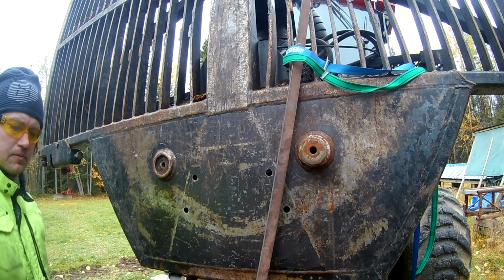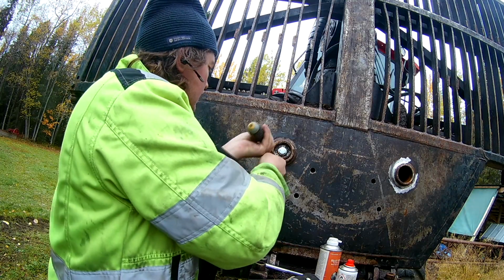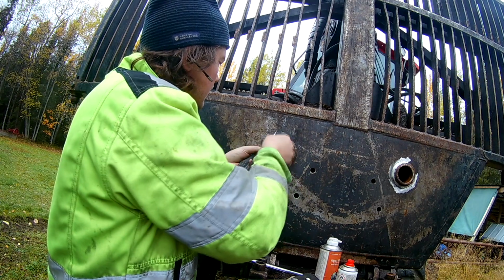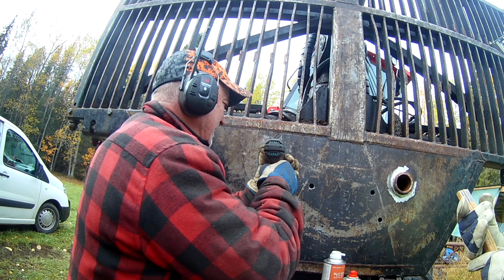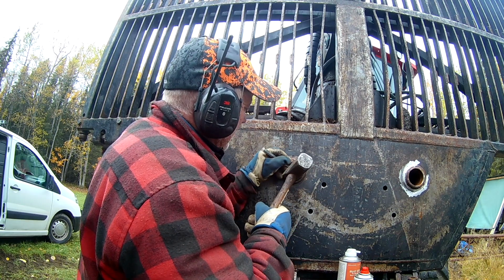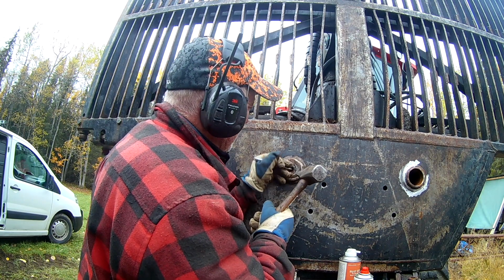And I started figuring out that there are threads in the pins that connected to the base of the crane, so you could kind of compress the washers, made it a whole lot easier to get the circlips off the other side, and with them compressed it was a lot better access to grinding enough away to get the support ring out.